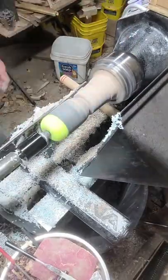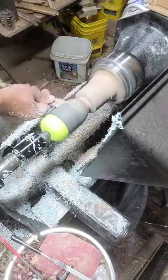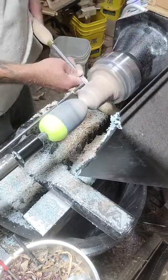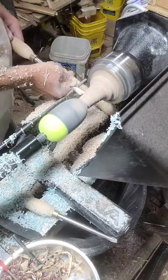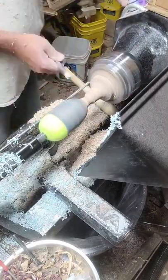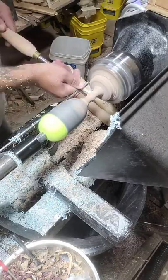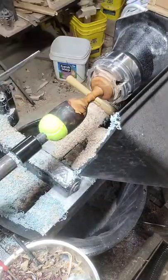If you haven't figured it out already, I decided this was going to be a goblet. I always say the wood tells you what it wants to be. I have some resin down in the bottom half that I thought about using for a thicker pedestal base to keep some of that resin in the base, but it just wasn't going to work. So I finally decided to put a more traditional stem on it. I would have made a thinner stem normally, but there was some wonky inclusion in the top end of the stem from the burl, so I had to leave it a little thicker — but I like the shape.